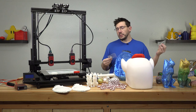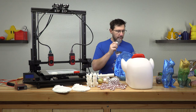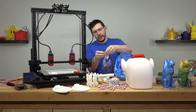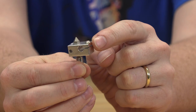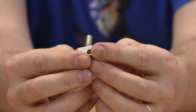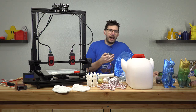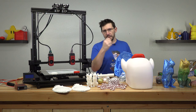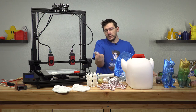A quick replaceable hot end — I don't believe that's really the case. These are the hot ends they give you, with various nozzle sizes and one hardened nozzle, which get replaced up in here. But it's not just plug-and-play. It's a hardened nozzle on this one and it's a heater block, so the heater block still needs a core and it needs a thermistor. The core is already in here and you just have to loosen a set screw to pull it out, but the thermistor wire is really fragile and I knew if I unscrewed it I would break it. So I did not try any of the other nozzles.